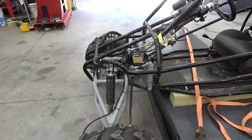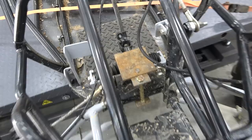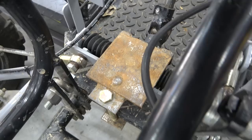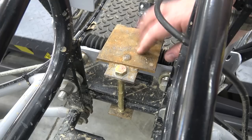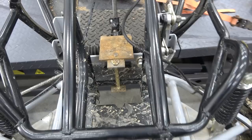One other problem he ran into was that the steering rack on this is aluminum, and it ended up snapping one of the bolt holes. I can't really show you how it's sitting in there, but you can see the movement in that thing. If the tires were on the ground, you could see it more, but you can see it's got some flop in it. He really quickly came up with this bracket just to hold it down so it couldn't come up. So we basically need to put a new rack on it and then either upgrade this part that he made or something just to help hold this whole setup down. We use a different rack now, and those racks are good as long as you brace them well. We didn't know that because we never had one fail until this one, and it actually snapped and turned his wheels all the way to one side, and he ran up a bank and flipped it.